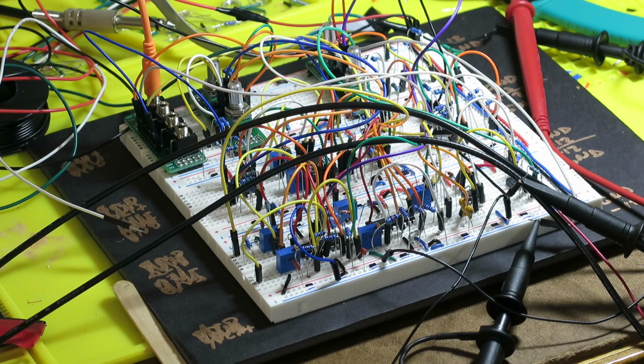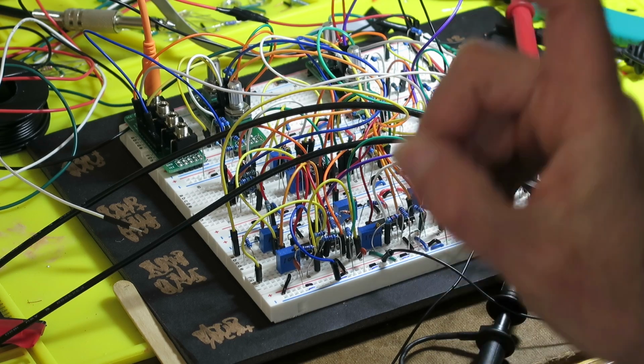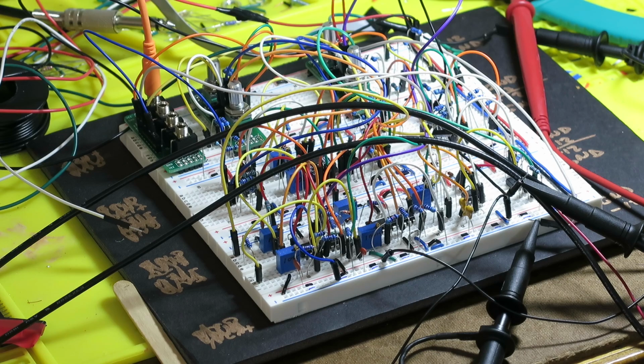And I think what happens there is that you're no longer getting exact cancellation of the pulse width fluctuations, or the amplitude fluctuations translated to the pulse width. I don't think you get exact cancellation anymore, but you get some cancellation. It's better than no cancellation at all, and you get the full 0 to 98% pulse width range. It's like when you have 12 volts on both ends. So unless I'm overlooking something, this gives you pretty much the best of both worlds.